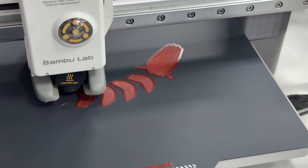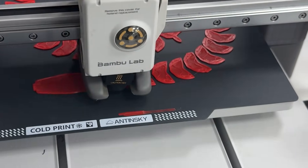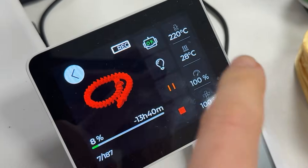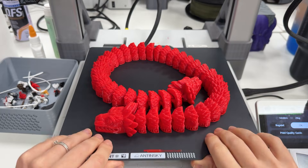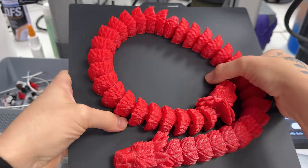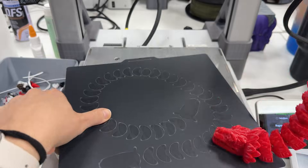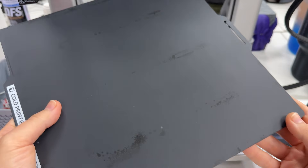With the first layer at 65 degrees, which isn't cold at all, everything went fine. After that, the plate cooled to room temperature and dropped to about 28 degrees. I got a little nervous, but the print finished successfully. Before removing the print, I let it sit there for hours and when I finally went to take it off, it was still super stuck but surprisingly easy to remove. When I took the print off, I noticed the plate was heavily marked. That was a downside — it's pretty at first, but after printing it gets all marked. I thought those marks might be from the high first layer temperature at 65 degrees, so I jumped straight into the second test.